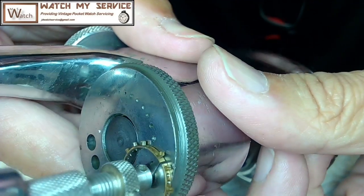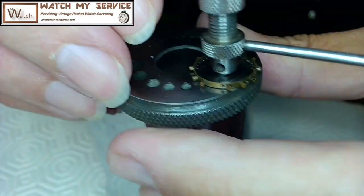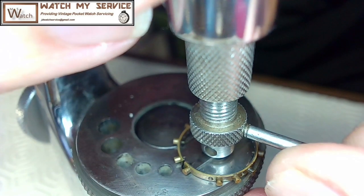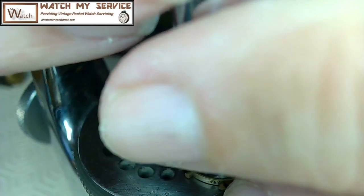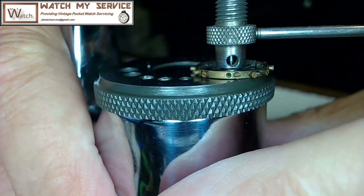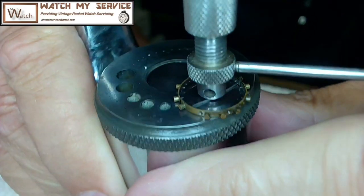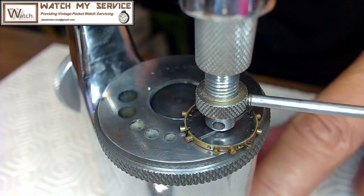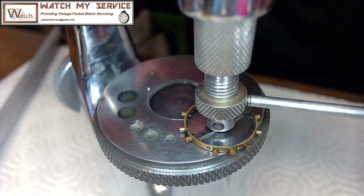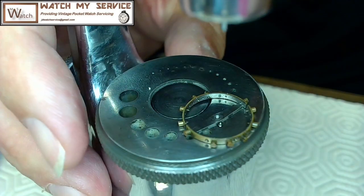That should allow me to knock out the staff. I'll push again against the top of the staking set a little harder to make sure it's nice and snug, and look at it from all angles. I'll loosen it just a bit. I want to make sure it is snug in there — push down and look in the hole again. I'm not going to pull that up this time — I should be able to knock it out now. Get the hammer, and the balance should go down through here.